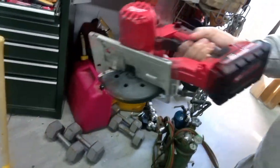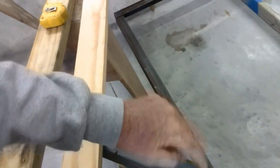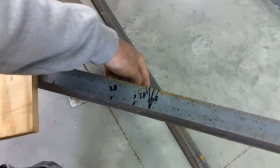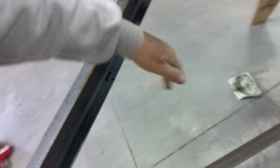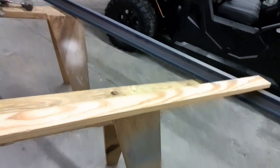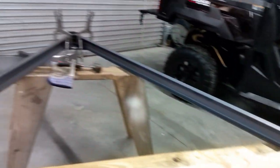I've got my Milwaukee — I don't love these little Milwaukee tools. This is a little Milwaukee cordless made for cutting steel. I've got a steel cutting blade in there and I'm just going to lay these flat and cut straight across to cut my notch out. I might take it to the bandsaw just so I've got a perfect cut all the way across to both sides, and then work my notch off of that with the steel saw. Then we mock it all back up, set it on the trailer, and make sure it works the way I anticipate.